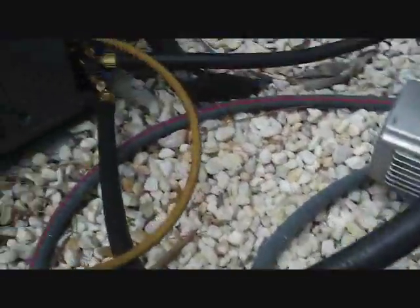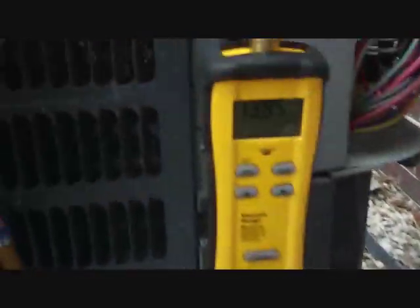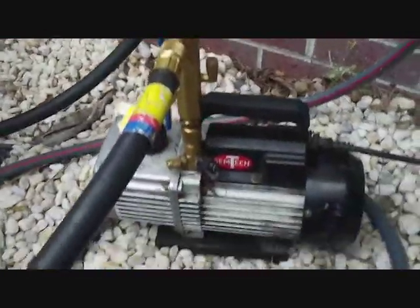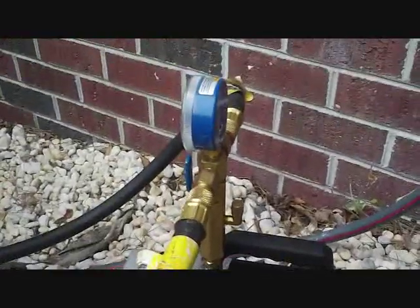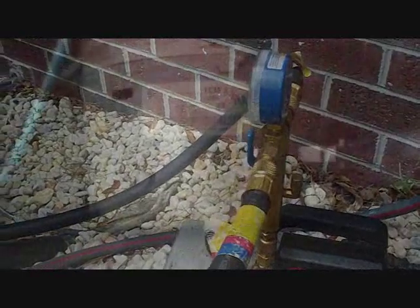The vacuum's been running for a few seconds, it's quieting down now and does a real good job. It'll come down a little bit slower than it would on a completely dry system — it really skyrockets on dry systems. If you have a brand new line set and a brand new coil, it really zips down.